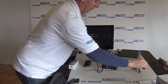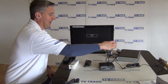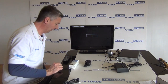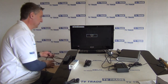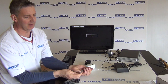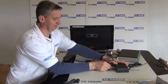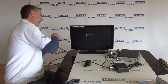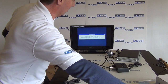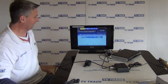We have that connected, and now we connect the power supply. We've taken the signal from here and run it to the modulator. We can now run a cable from the back of this unit directly into the normal RF input on the back of the TV. I have a pre-made cable here — on one end an F-type connection, on the other end a traditional RF connection. I push this into the modulator and into the back of the TV, and we can see the output from the Sky box is now being displayed directly on the TV.